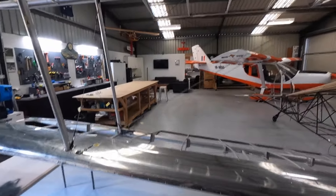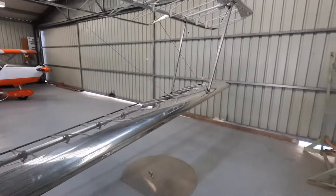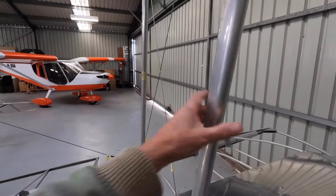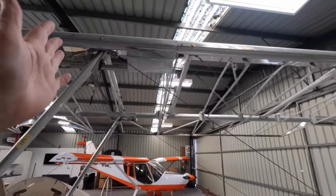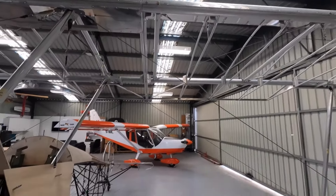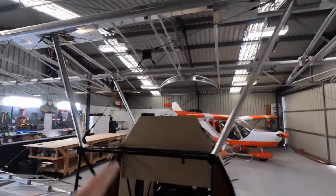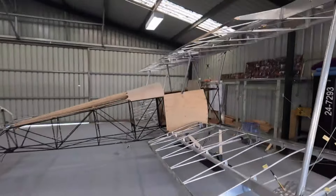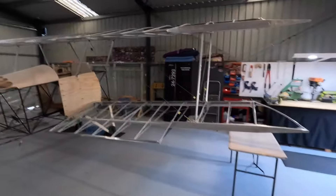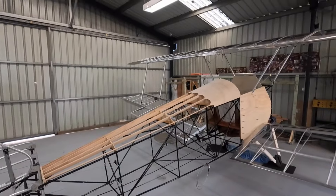Next morning. Notice I've dropped the flying wires and all the bolts are loose. I've got a trestle ready. The plan is to get a couple of guys to hold the struts — notice the ailerons are off. I'll knock the bolts out, undo the cables, the bottom wing should pivot down, we separate the top wing, I've disconnected the aileron cable, the top wing should pull away. Drop both bottom wings onto the floor and I may have a go at taking the cabane off. I'm not going to film too much of that — I've got three or four guys coming down to help.